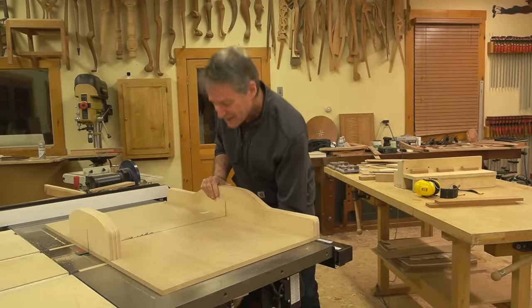Yeah, so this one I have set up actually for the round chair class that we're gonna be using in a week or two, using it for cutting dados. So you can have specialized ones. It's shorter, so it's just for obviously cutting narrower pieces. But I didn't wanna cut a big gouge or a big dado in my main sled. Once you do that, you could put a sacrificial base, but I'm trying to preserve that one. So nice to have a few sleds around.